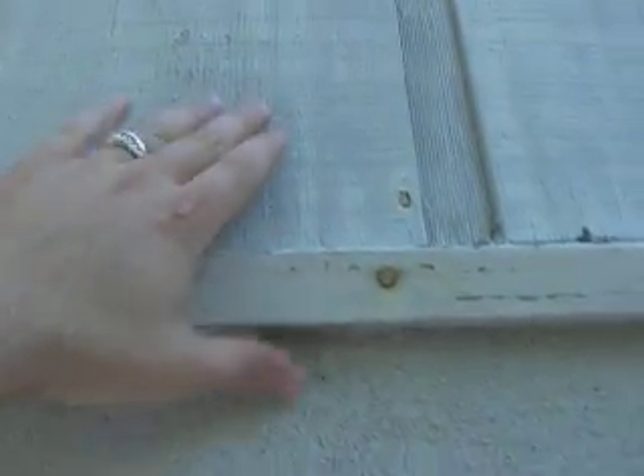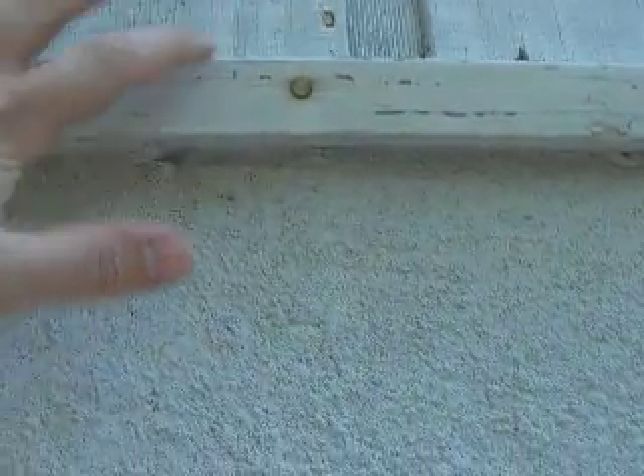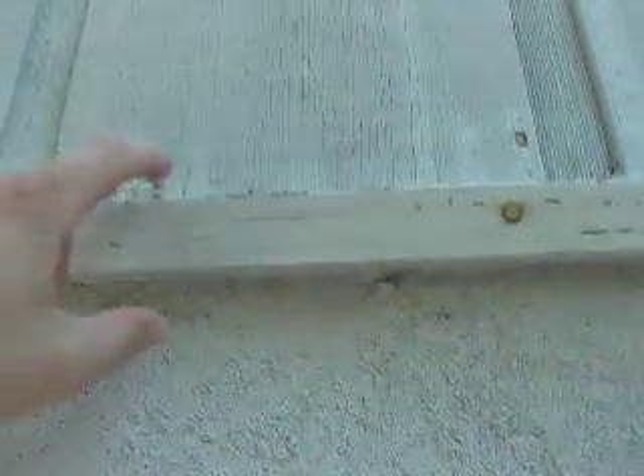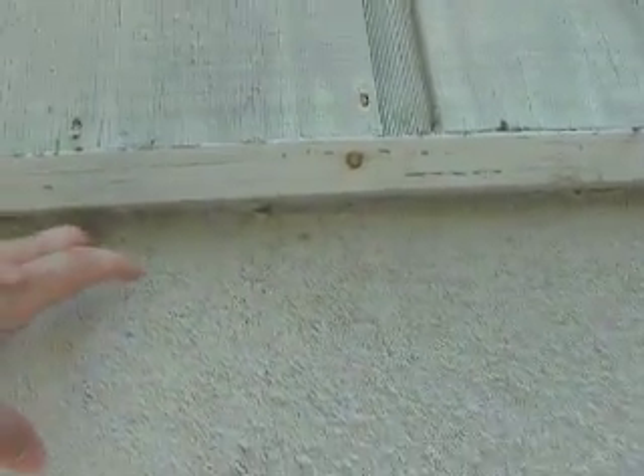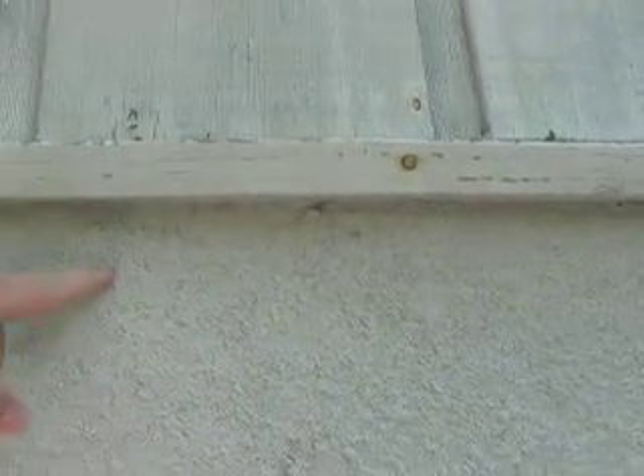That water table is going away. We're going to bring the siding down so this plane is the same as this plane, and bring the siding down to cover up any area that may have chipped from the stucco. One thing that will have to happen first is that we cut out any bottoms here that we need to, take this out, score here by the stucco so it doesn't crack — or at least limits the cracking — and then find where we need to run our siding and bring it down on our first lap.